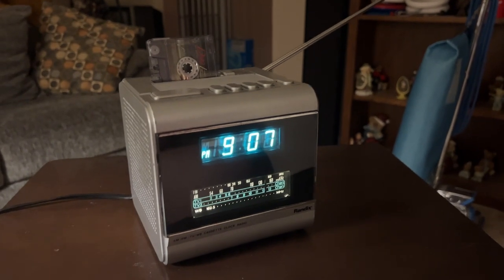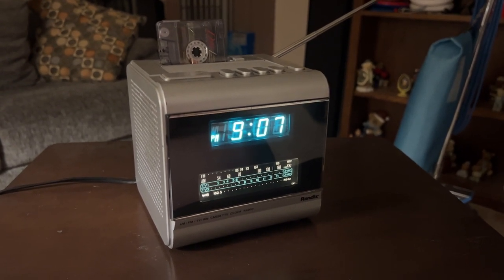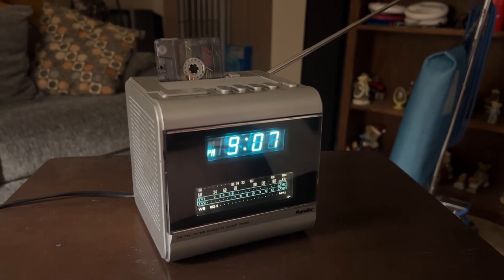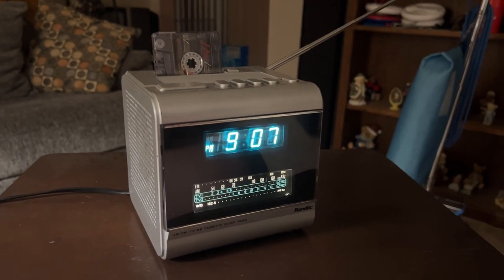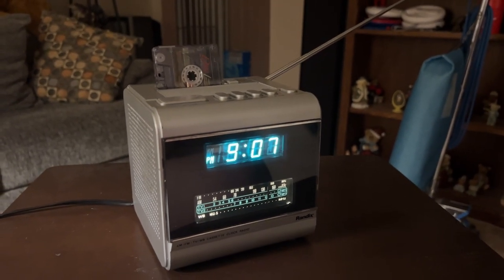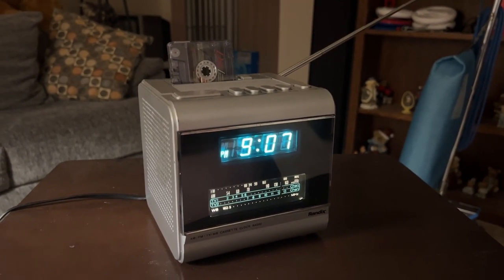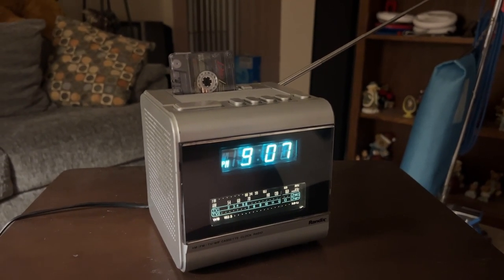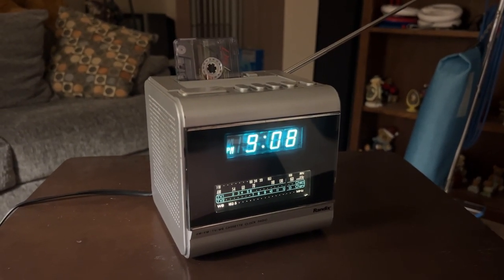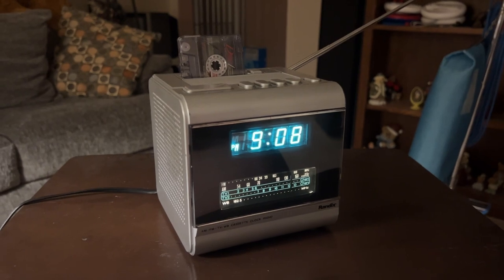I'll eventually get a video done on this, but I got my video game systems all hooked up through an AV switcher, and the Genesis, I have a VA2 revision, which is the first revision of Sega Genesis you could get in North America, and that model only outputs monaural through the AV out. But if you take the stereo headphone jack and hook it up to anything line level, then you can get your stereo. So I did that, and I still have to demonstrate the stereo I'm using in there because it's pretty unique, I'll say that. And let's just say I recorded some Sonic the Hedgehog.